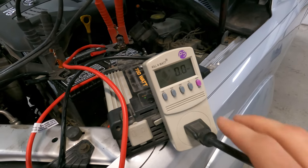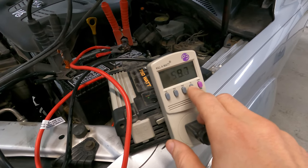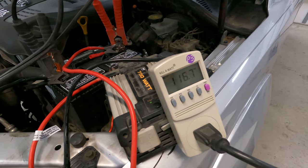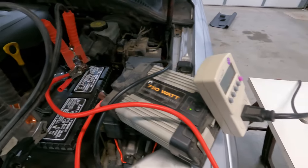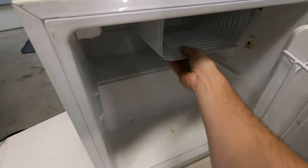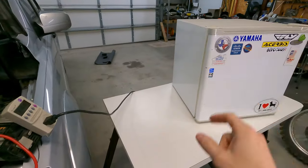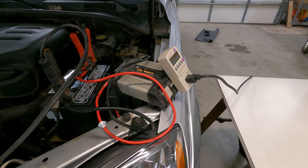This has been running for about 40 minutes and it actually just shut off. It's at zero watts, zero amps, power factor of one because there's no current being pulled, and it's showing 116 volts. The fan on the power inverter also shut off — so that's great. Our fridge is cold — it's really cold. It actually feels like there's a little bit of frost starting to form on it. So the question was: will this power inverter run that mini fridge? And the answer is yes — it successfully ran it for about 40 minutes, no problems.